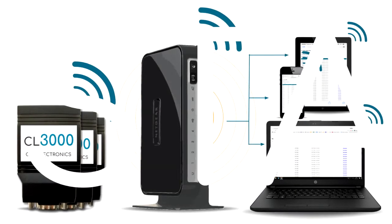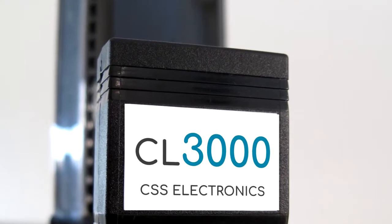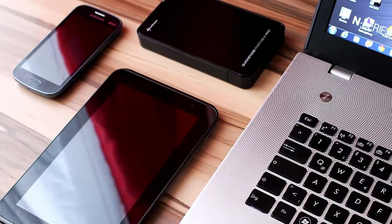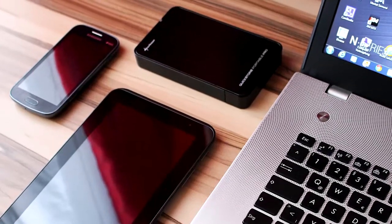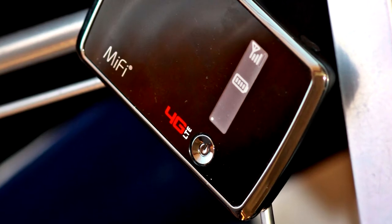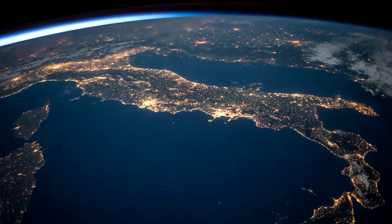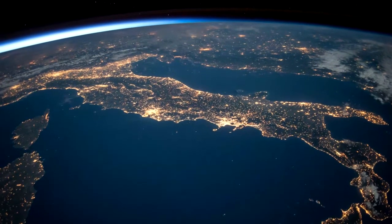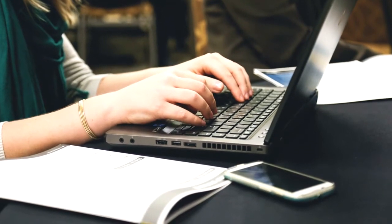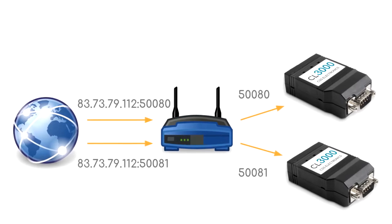Number 2 — Station Mode. The logger can easily be configured to auto-connect to an existing Wi-Fi hotspot. Once connected, your data is accessible via any device on the network via your link and password. Note that a hotspot could be, for example, your local network router, a PC, phone, tablet built-in hotspot, or mobile hotspot in trucks. If you want to access the logger outside your local network, this can be done if you are on the same VPN as the hotspot. Alternatively, you can easily set up port forwarding to turn your access link into an online website for easy global access.